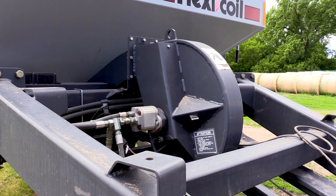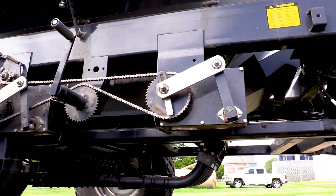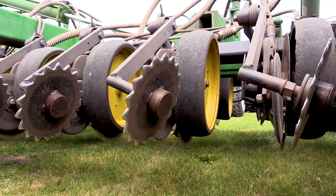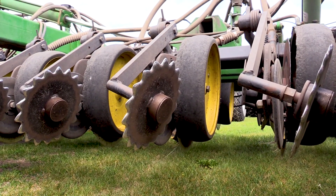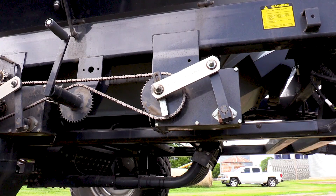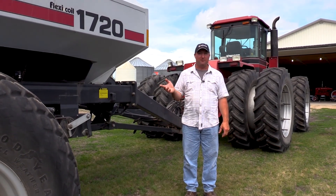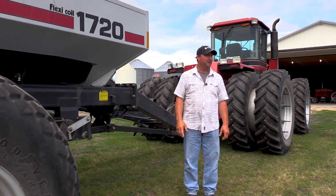The air tube system starts with the fan — this is what provides the air pressure. It blows the air underneath through all the tubes, which feeds the seed all the way to each individual disc opener. There's a crank underneath that drops the whole seed assembly for calibration. We ended up cranking it 25 and a half times for one acre's worth of seeding, and we weigh that on a scale in the garage down to a tenth of a pound. The calibration on it has been fantastic.